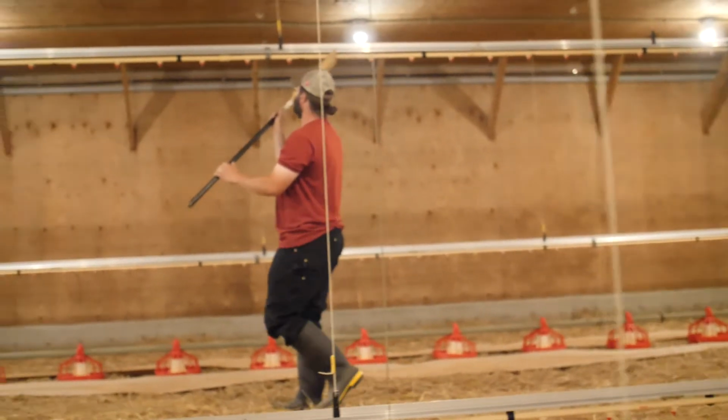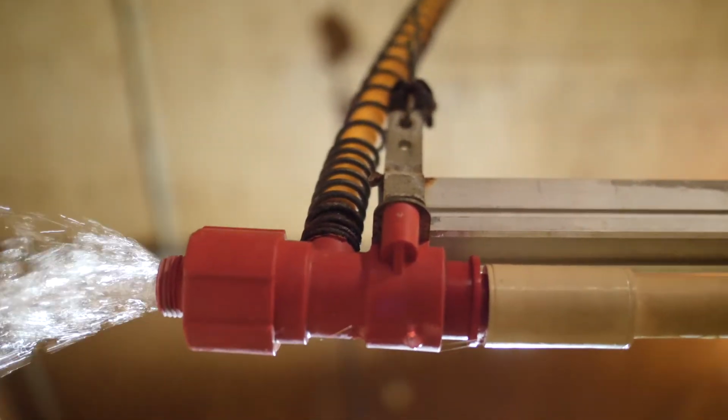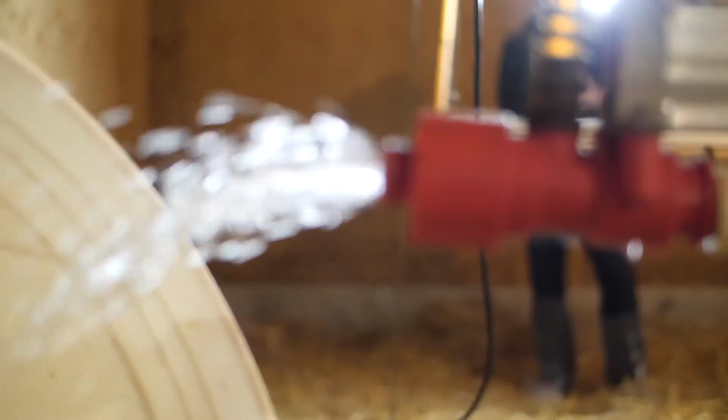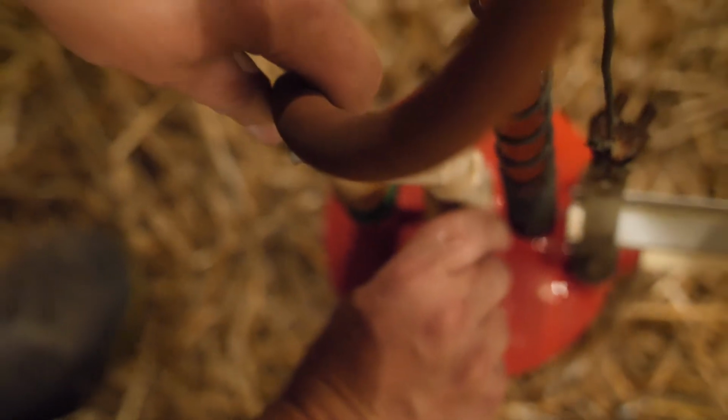A high-pressure flush of 5 minutes or 1 minute per 100 feet of line is necessary between each of these steps. Peroxides produce gas when they contact biofilms, so the system must be open to prevent bursting the water line.